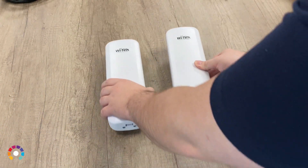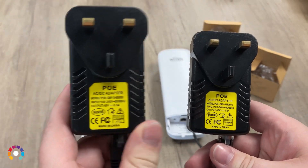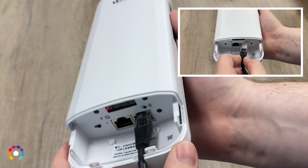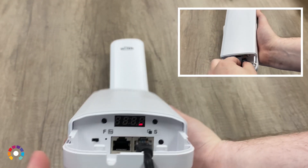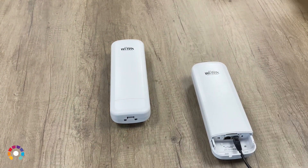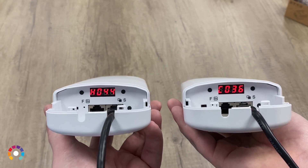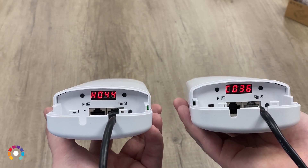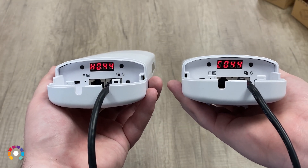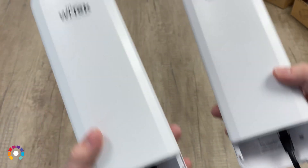Now I'm going to show how easy it is to pair these up. Using the 48-volt PoE injector, you plug these into a mains socket, and just using the included cable — I've used a black cable because that's what we had — you plug that into the WAN port on the right-hand side. They'll start scanning and both land on different channels, but after about a minute or two of waiting they'll eventually pair up to be on the same channel. You'll get a C on the same channel and an H on the same channel — this is the host and the client.